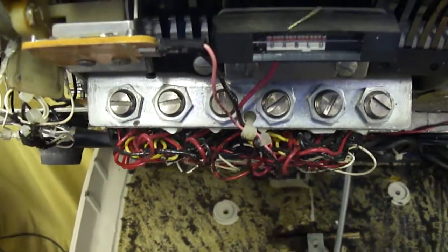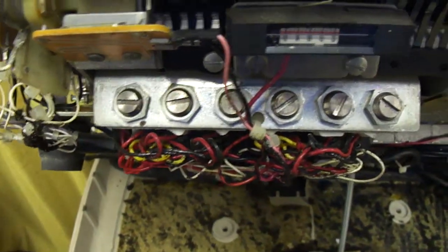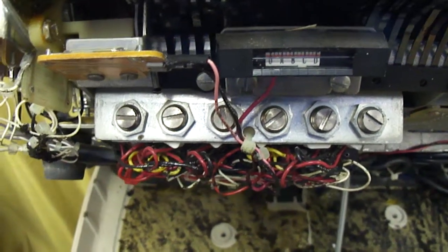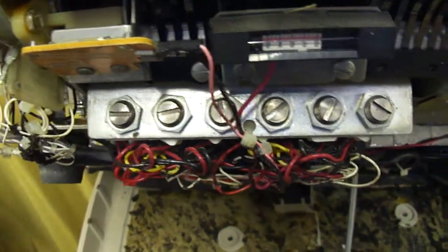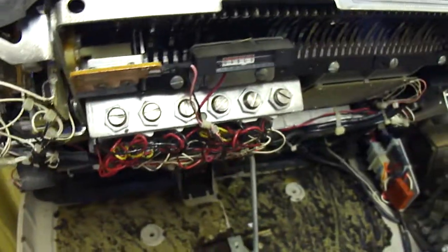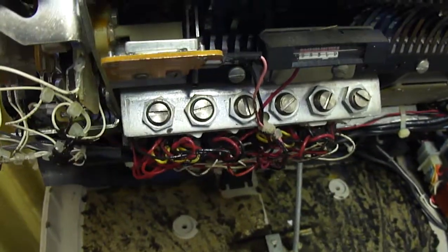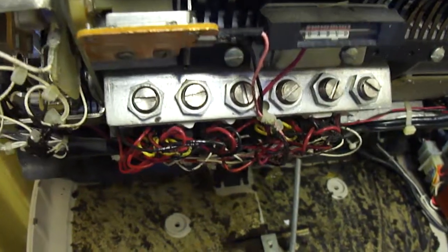So I'm going to keep working with these adjustments. I'm sure there's a procedure in the service manual for setting these, but since I don't have that with me right now, I'll just do it empirically and see if I can get it to consistently print the right characters. But at least I think I've tracked down what is making the problem happen.